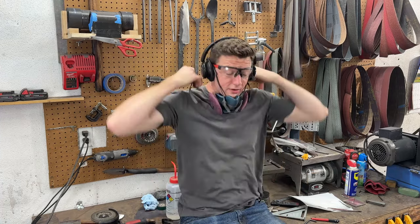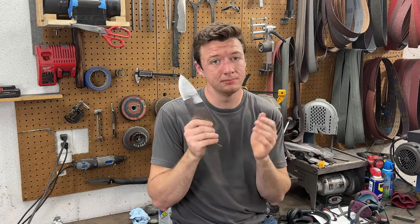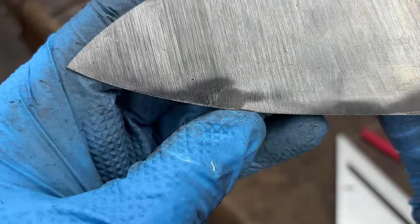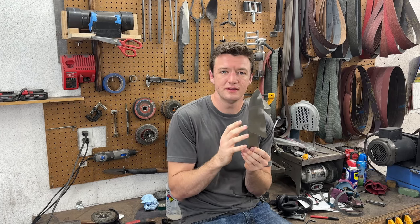There's a common saying in knife making: knife makers don't make mistakes, they make smaller knives — meaning if you make a mistake you can usually just cut the knife smaller, grind some material off, and find a way to redesign with what you've got. I made a mistake when I was grinding this section; it got too thin. This section is also incredibly thin. When I was making this distal taper I was a bit too aggressive and this whole section is completely bending now. I could grind this edge in, maybe reprofile the tip a little to fix this knife, but I don't have any interest in making this piece of steel a knife.